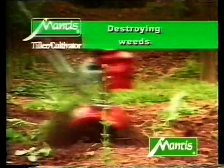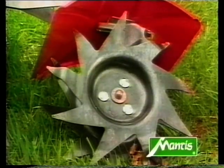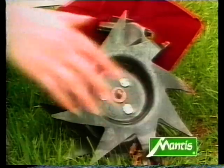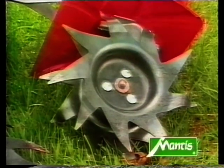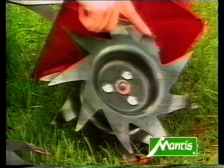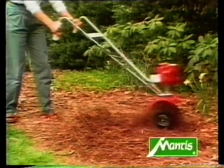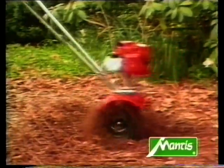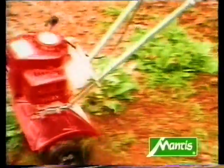Tilling is just the beginning — your cultivator copes with even tough roots. First, make sure the motor isn't running. Place the hoe blades in the hacking position: all you need to do is attach the right-hand blade to the left-hand spindle so that the blades are pointing backwards. Don't forget to replace the fixing pin. Take the cultivator to the spot that needs hacking and run the cultivator backwards and forwards over the trouble spot until the blades have split up the weed roots. Repeat the procedure until the soil is evenly broken up. This rocking movement chops up the roots and ploughs them in at the same time — you can do this even in tight corners without damaging your plants. Gardening made easy.